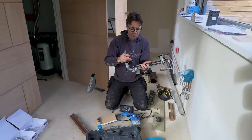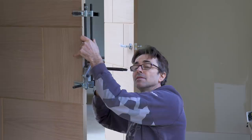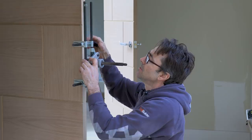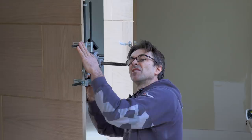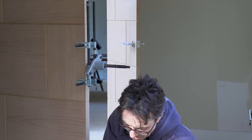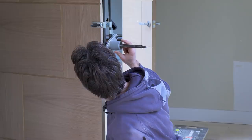The bit bolts into the back of here and then we slot this through there. The clamps have got nice rubber protector pads, and I put that to my first pilot hole which is the mortise I'm doing now. Tighten the bottom one up, then I slide the top one down until I line up with the top of the mortise. For the size of the mortise, we allow roughly five millimetres on either side of the latch - so on my piloting device you've got your centre hole, then five mill above and five mill down. That's what I'm lining up this first cutter with.